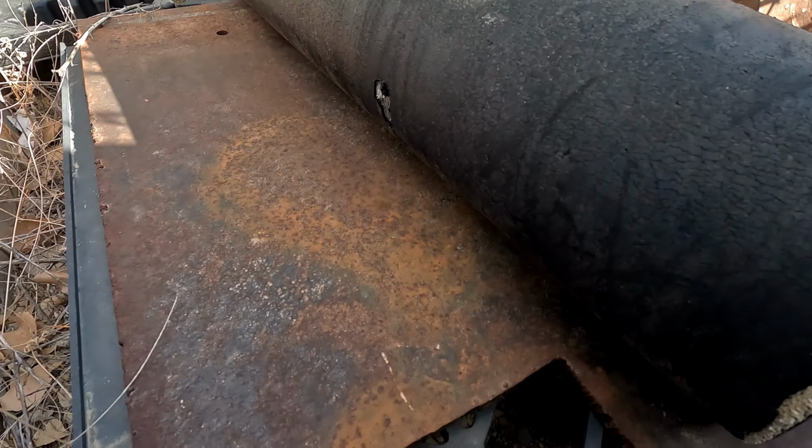These plates that I just dug out, I think this is 5/8 or 1/2 inch steel. Those are going to go on top of the uprights, and right underneath the beam, we're going to bolt the beam to these, and these are going to be our uprights. And we're going to use 2 of them, 11 feet tall or 10, we haven't decided yet, on each side.